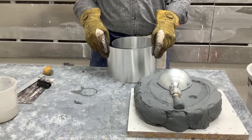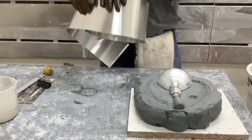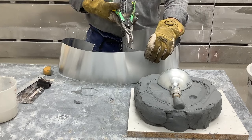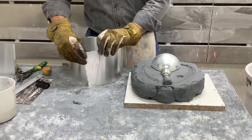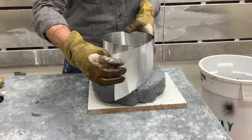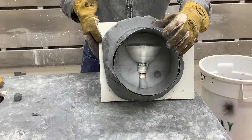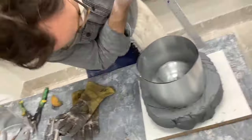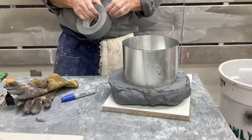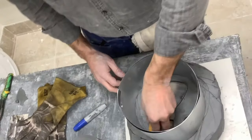You're going to be able to make two shapes of molds. The first I'll demo is cylindrical — here I'm using metal flashing, which can easily be changed to different diameters or sizes. It's important that you have overlaps, so you want it to go around a couple of times. Once you have the correct size, press it down gently into the clay where it'll hold its shape. Identify the fill line inside the form so you know when and where to stop pouring, avoiding an overly thick or heavy mold.